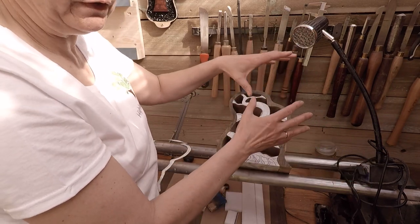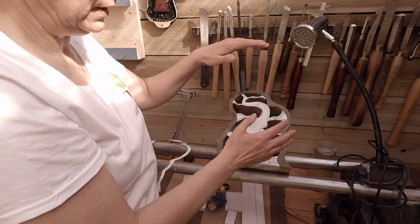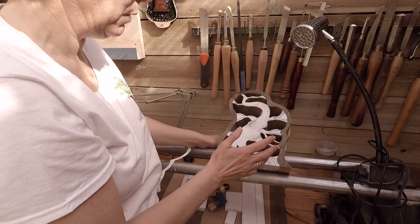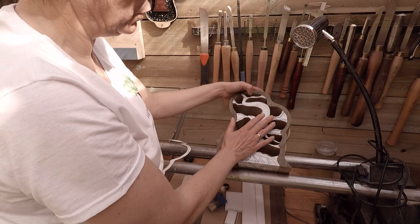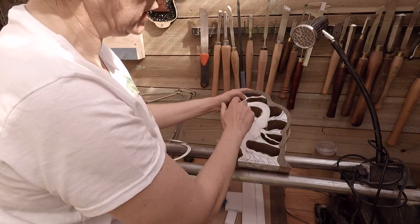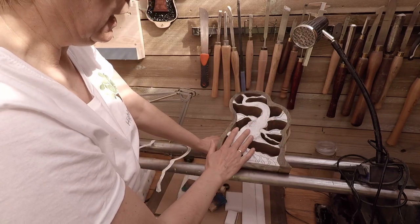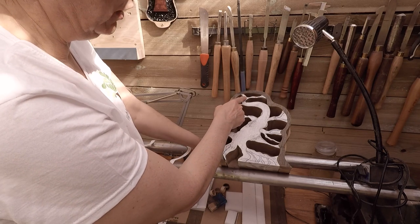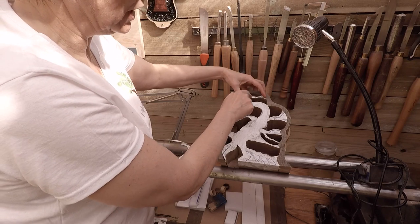But the grooves sort of give you a look like that's on different levels. I'm not that sure I'm explaining it that well. But anyway, I do it like that basically. I will place this onto some nice figured wood. I shall probably try to get the grain running the way that these would be running. And then at each interval, you know, I'll cut the first bit out. It'll only be about that long, and then I'll sand down the edges.